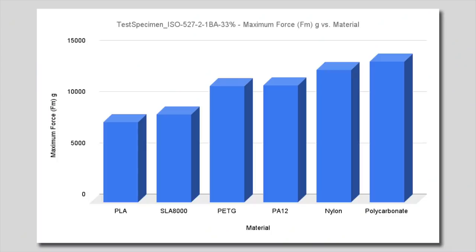Okay, honestly, those numbers are about what I'd expected. Polycarbonate is really looking good as an engineering filament. I'd say only go with nylon if you need some give to the print. And as before, if you need both optimal quality and strength, PA12 from JLC is coming out ahead.